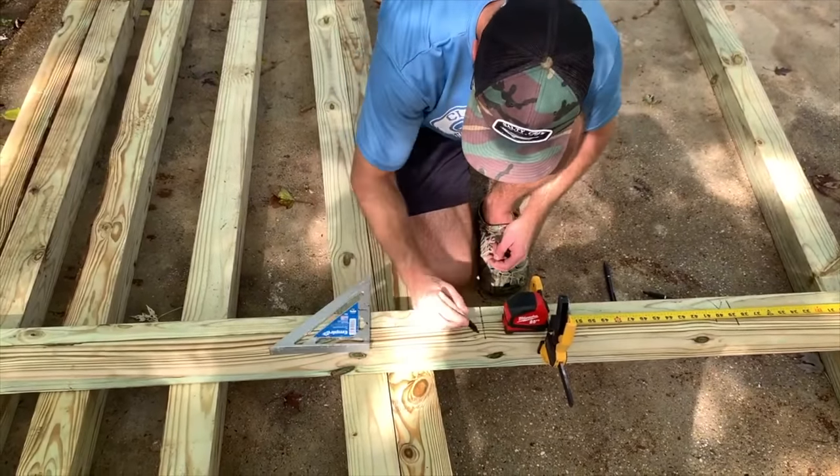So now that we have the sheathing installed on the front and sides of the shed, it's time to install the sheathing for the soffit. And this is kind of a pain. What you'll want to do is take an inventory of all the leftover plywood you have and then do some measurements on the bottom side of your shed roof. If you're working by yourself, you're probably going to want to cut this plywood soffit sheathing in smaller, more manageable sections. But the important thing here is that you line up the soffit sheathing with the edge of your roof rafters, so it's flush with the fascia board on the front, and you want to ensure that the edge of the soffit sheathing lands in the center of the roof rafters.